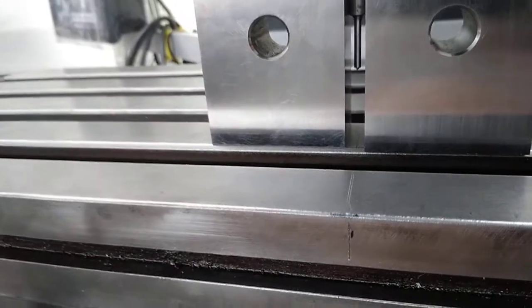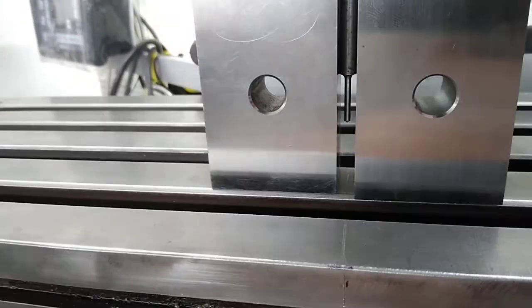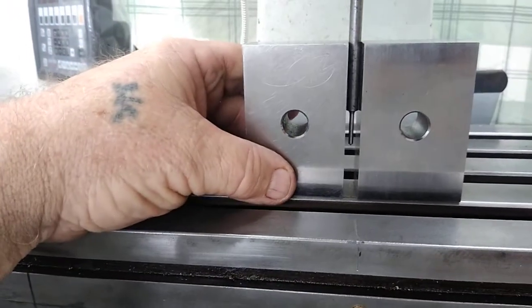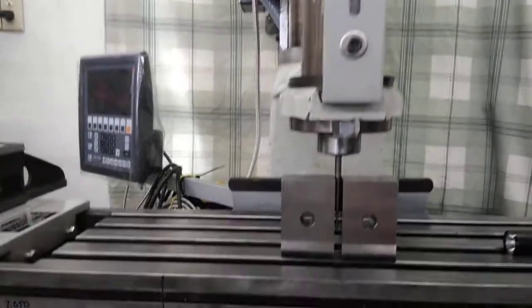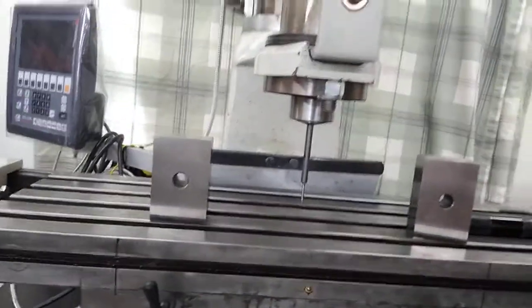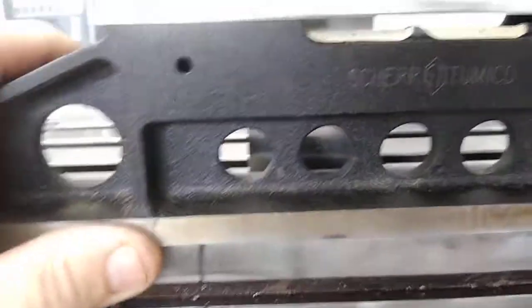It's a little bit of an angle to see, but we are tracking. I didn't bother with the feeler gauges since I've got one hand working the camera. It's a good way to do it fairly quickly, and now I know I don't have any head tilt this way either — meaning there's not a lot of serious wear on this machine. Watching Blondie Hacks and Joe Pieczynski and others, it's sure nice to have this big 15-inch level — this thing is touchy.